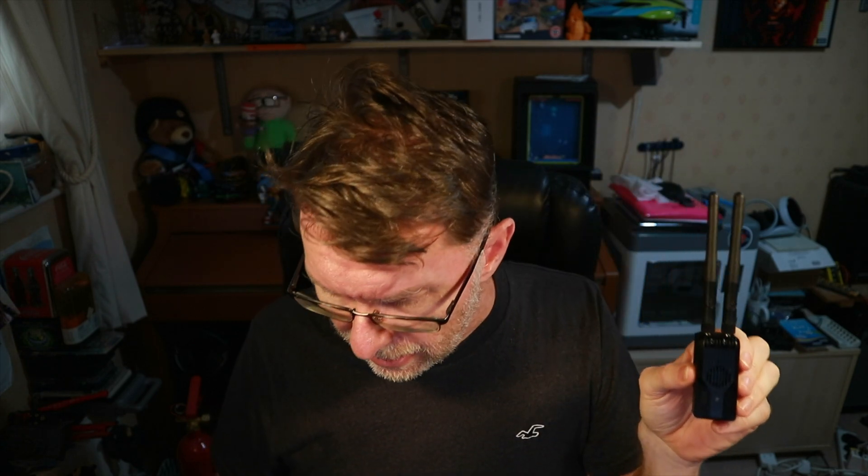This is the SuperG Nano transmitter from BetaFPV. It can still go up to one watt, which generally as far as ELRS goes will get you an awful long way. It's got two physical buttons here that do things like increasing and decreasing the power. You've got the option of running in Gemini mode as well as switch mode and single antenna, and hand in hand with their True Diversity antenna you could do a lot with it. In terms of use cases, FPV race events where you may have a lot of people on 2.4GHz putting a lot of noise out might be very useful. Long range stuff too — sometimes you go through a point where the signal drops and recovers due to interference in certain areas, and the alternative frequency might solve that issue, allowing you to go further with a higher LQ.